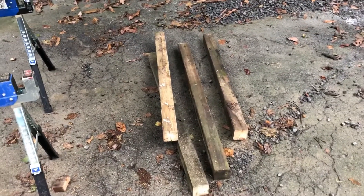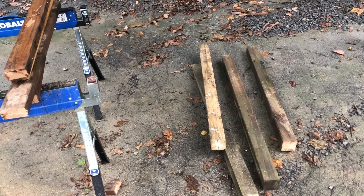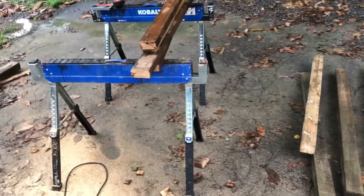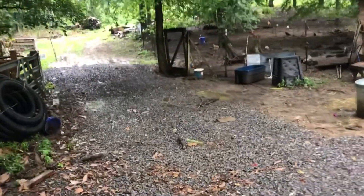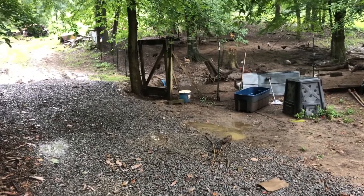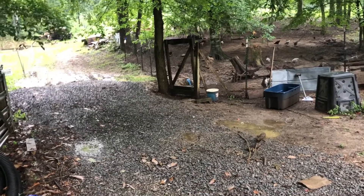I now have my posts cut. It's going to be 5 feet tall in the front of the shed and 4.5 feet tall in the back so it's sloped and water can run away. It's going to be around 4.5 feet wide, intended to hold two goats, and 5 feet deep. If you ever build a shed in a fenced-off area — which we are — I'm going to have to fit it through a gate that's probably only 3.5 to 4 feet wide. So I'm going to build as much of the shed here as I can, carry it up to where I want it, and assemble it there. You don't want to build a whole thing and then realize you can't get it where you need to — not that I've ever done that before.